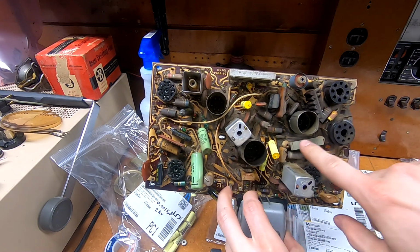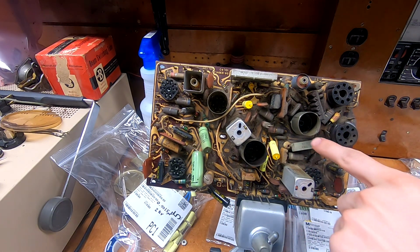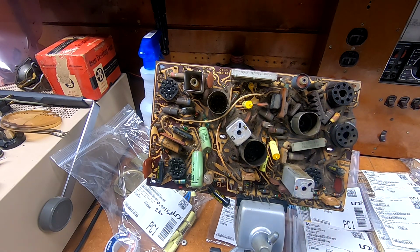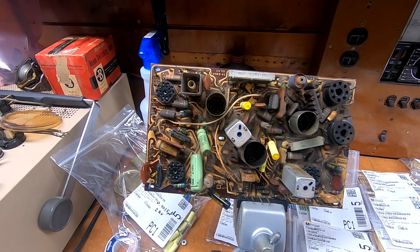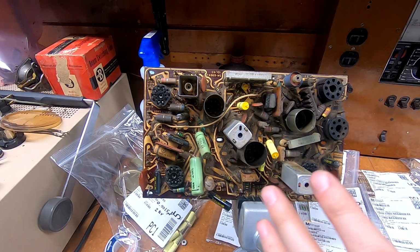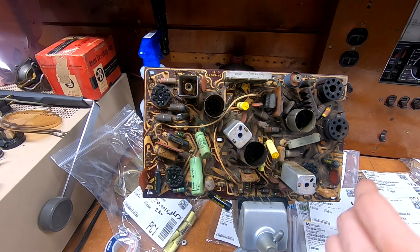There's also a cement resistor on here that's a little over 4 kilohms. That one I didn't buy a replacement of because the cement resistors are wire wound. They don't tend to go bad, or they don't tend to drift, I've usually seen. Not like a can dome or something. But the carbon comp resistors, yeah, they can absolutely go bad and drift. And considering how hot this thing gets, not taking any chances. Everything is getting replaced except for the ceramic discs. They've got pretty good lifespans.